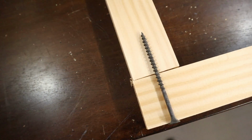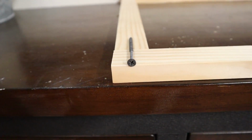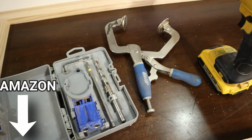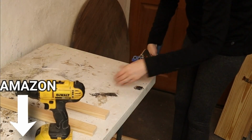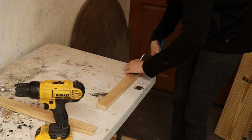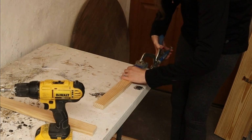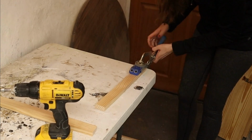There are a couple options of how you can put your piece together. You can use these 3-inch long screws and just screw them right into the corners to keep it all together. Or I'm going to be using a pocket hole system. This is the Kreg jig, and I will link it down in the description box if you're interested in that. Basically, it makes holes in the back of the piece, and it makes a really strong connection once you screw it all together, and then you never see the holes. So it's a pretty cool system.